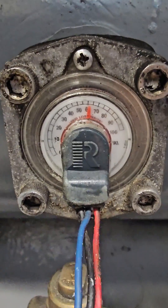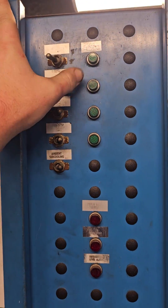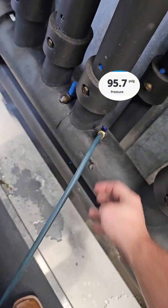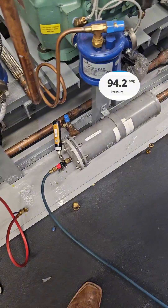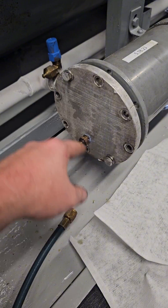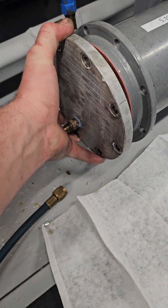That's going to warm up the casing and help boil off the refrigerant. We'll monitor the liquid level of the rack and make sure it doesn't go above 80. It got to about 75 and I called it quits. Now we only have vapor — even though we have 180 psi on the liquid canister, we'll dump that gas into the suction header of the rack and start to remove the bolts.